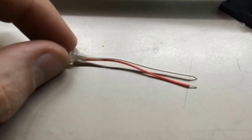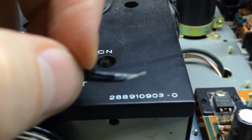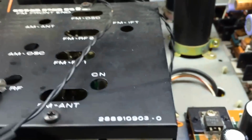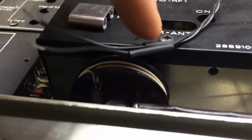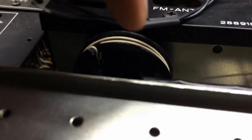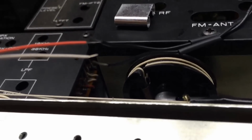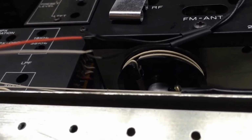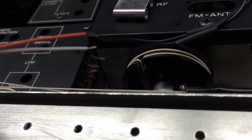All right, I've got a new bulb laid out here. I have cut the ends on this one and this, stripped the ends, and twisted them really good and tight. If you'll notice, I've slid two really small pieces of shrink wrap up on this a little bit, and what I'm going to do is solder these on one for one, and then we'll pull the heat shrink down once it's soldered, and we will use the heat gun. Be right back and show you.